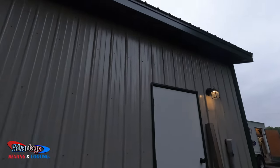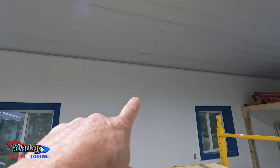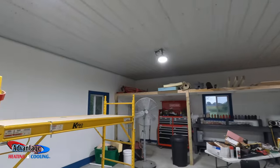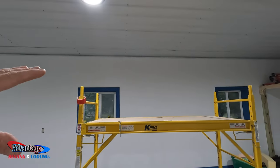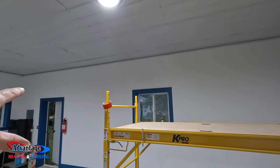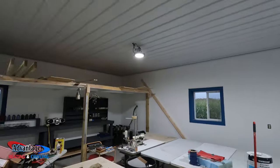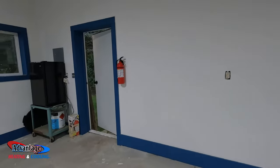Okay, that's good right there. I don't have much leverage once it gets to work. So we're going to be installing a mini split ductless system — Fujitsu. We're going to put a head here and a head here. The biggest thing with something like this, you want to basically navigate where you want the head units to go. I'm thinking in between these two windows is a good spot, because basically we got to heat and cool this area. We're 1200 square feet, very well insulated. The ceilings are going to be really well insulated.